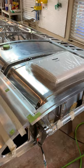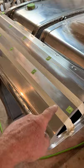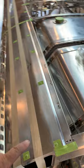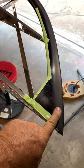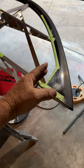I'll show you in the forum post how to measure to put the tapes on and where we're going to start the fabric. The Cub Crafters video is pretty good, but when I was at Cub Crafters covering a wing for my first airplane, what's changed is the location of starting the tapes. In the old video, the fabric wraps around and comes back short at the tip bow requiring a patch. Instead, they've moved the fabric so it gives enough to cover the tip bow in one single piece - much nicer.